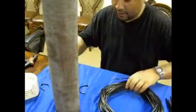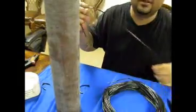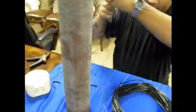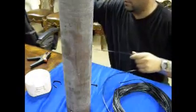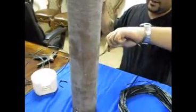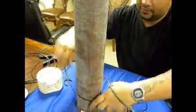This coil will be slightly different because this one will not take the triple wrap, it only takes the double wrap. First, you want to start out with your lead, which is about 10 feet or so. Secure the wire down like we did on the first one. We have larger zip ties for these.